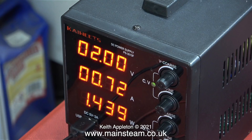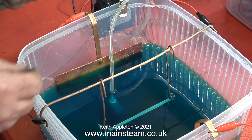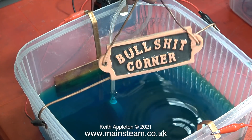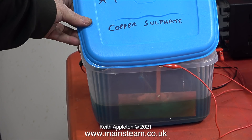After two and a half hours working on something else, this is what it looked like when I took it out of the bath. I'm quite pleased with this — I don't know exactly how much copper has been deposited, and it's not very shiny, although I think there's a way to make it shinier — I'll keep you posted. I like to keep things simple and not too dangerous. I've been doing some bedtime reading about commercial electroplating and it's a bit scary — some of the electrolytes contain cyanide and other harmful things, and I don't want to electroplate in the morning and then expire after dinner.